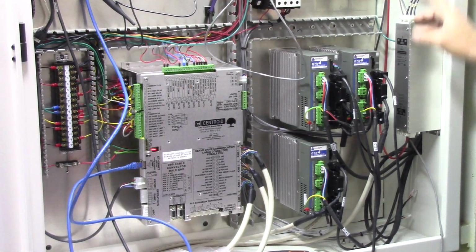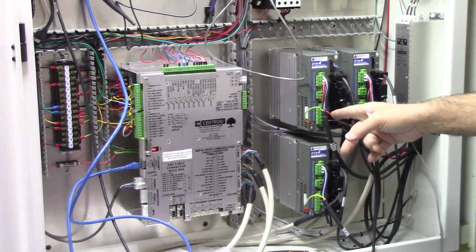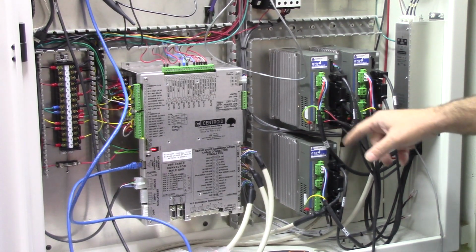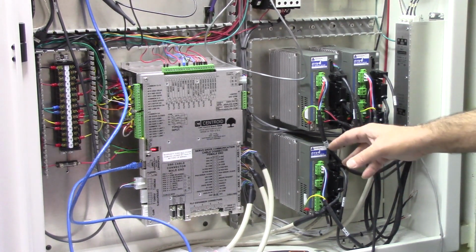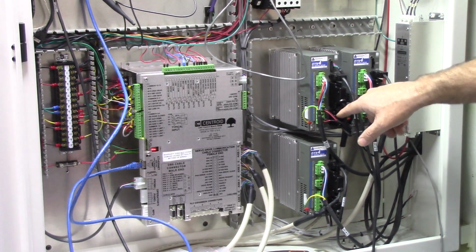Okay, here's the filter coming down from the switch, this line filter, of course. Here's the DYN4 AC servos. Again, L1, L2 is logic power, R and S is motor power. Those are coming from that e-stop relay and so forth. And we've got the data cables going into this DB25 and the DB9.